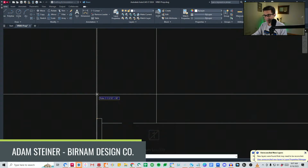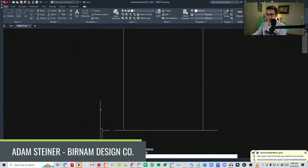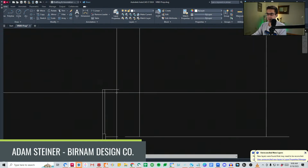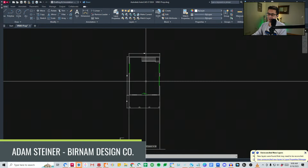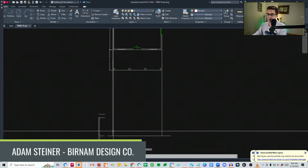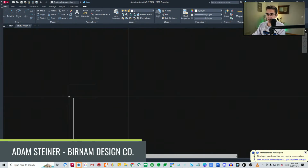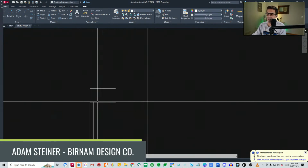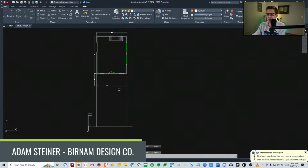All right, let's see if we can do 10'1" at an 1/8. So that's a 10-foot stud space there. And then if we clear span this, it's 27 feet inside to inside. It's kind of a big span, but we could clear span it with a 24-inch floor truss. Okay? With me? Everybody cool with that? So that's an open web floor truss. If we're insulating this or wanting to finish it a little better, this could be great for either mechanicals and or insulation. You're potentially finishing just the top of that.